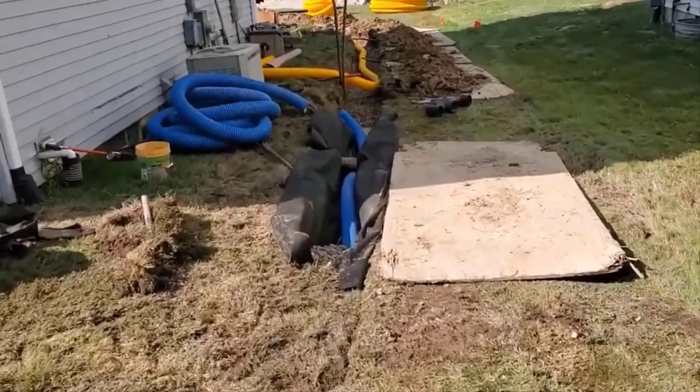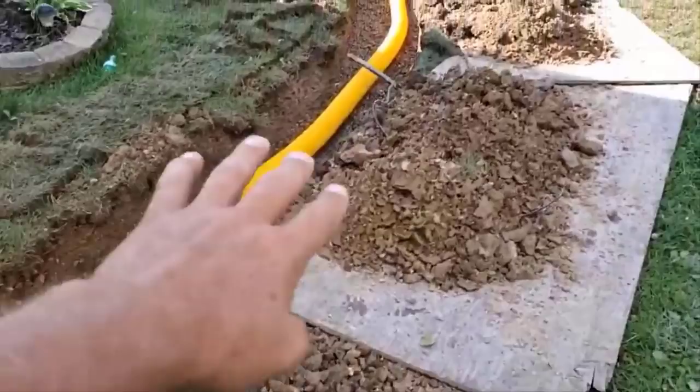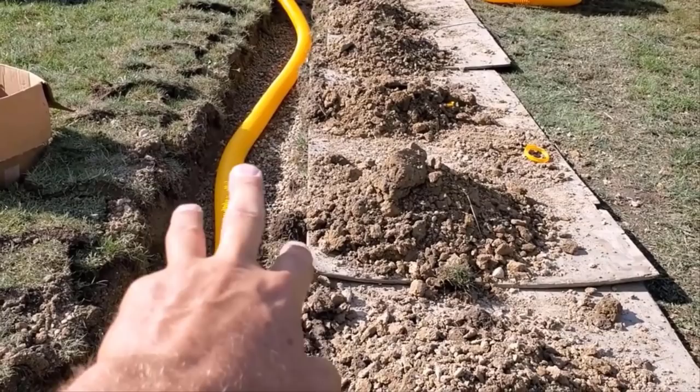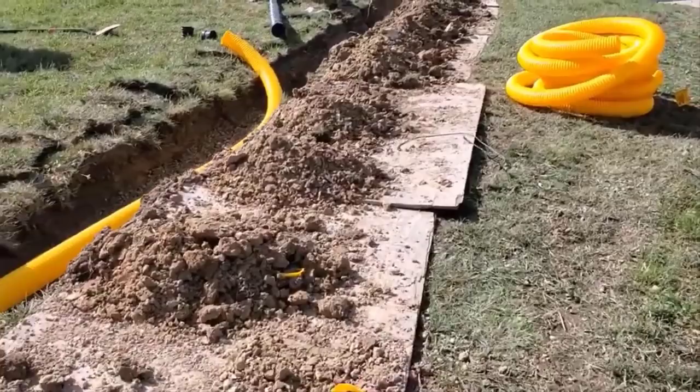So we take the high octane to a manifold, and there's going to be knife cut that the guys are going to put in here. And there's going to be three fingers of knife cut. And the two on the ends, to the left and to the far right, are going to end up with an internal end plug. And then the center one is going to go to a solid piece of corrugated pipe, the Boffman solid.